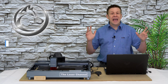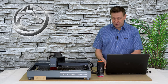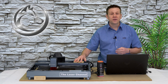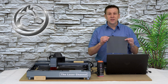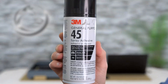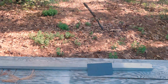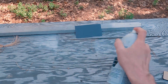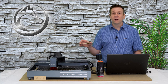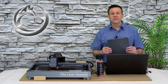My next tip is going to be adding a splash of color to the project. For this I'm going to be using some iron lac spray paint, and I've got another piece of sample wood material. I'm going to be laser cutting a mask to go on my work material. The mask material is going to be simple black construction paper, and to get the construction paper to stick to my work material I have some 3M general purpose 45 spray adhesive. The key is to spray a very light coating on the construction paper and give it 1-2 minutes of open drying time. This will still allow the paper to be tacky enough to stick to my work material, and I'll still be able to pull the mask material off, revealing our cool spray paint design underneath.